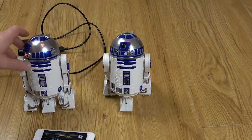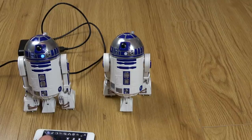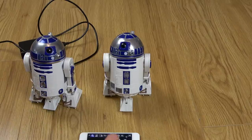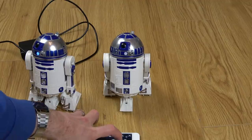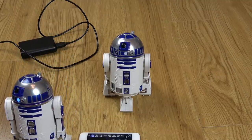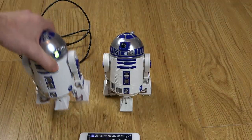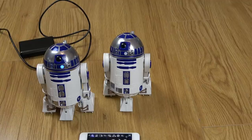So initially you'd think it's not a battery problem, but now I'm thinking it might be a battery issue - that's the reason I wanted a unit with a different fault so I can swap the batteries. Right, he's going now, and if I try movement he falls over. At least he's trying to move. Also the leg's not retracting - when I do this one he should whizz across the room, which he does, but at the end the leg should go up and it's not. Right, let's disconnect both and take them apart.